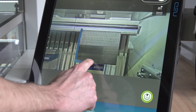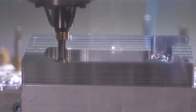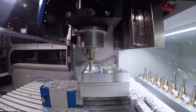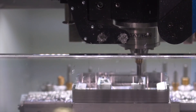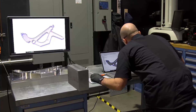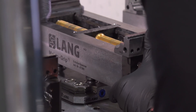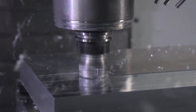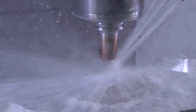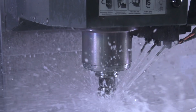We're going to start by loading a part into the machine and watching both-ways adaptive clearing in action. Here, we can clearly see an adaptive toolpath producing both climb and conventional cuts. While you likely wouldn't use both ways in hard materials, it does provide significant advantages for large parts and soft materials by reducing the need for long repositioning moves. With fewer repositioning moves, we're constantly improving the efficiency of adaptive clearing, helping you deliver more quality parts in less time.